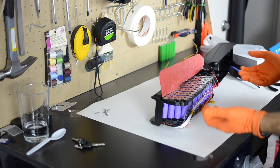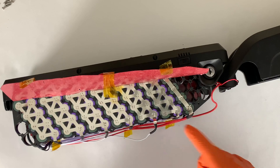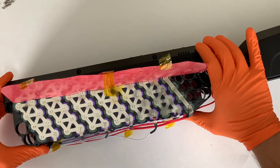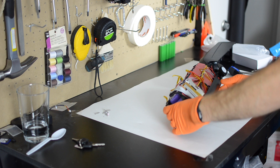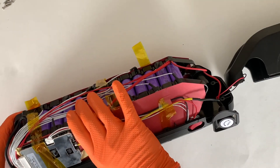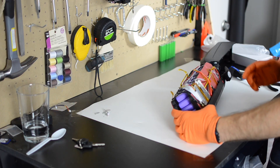In the meantime, there are only a few more things we can look at superficially here before I close it back up. I do see that there are green insulator rings here on the positive terminals, which is good — that prevents the nickel from creating a short circuit over time if it rubs and chafes on the cell's heat shrink. One thing I also want to check for is an external thermal probe on the BMS. On this side these wires are for the switch, these wires are for the USB, and we have no other wires besides the balance wires coming off.